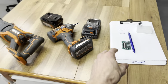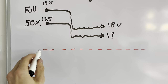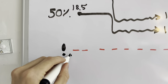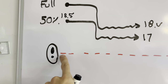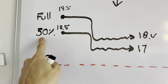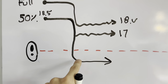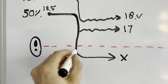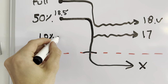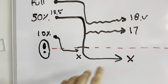Here's how that looks. Inside the battery you have a battery protection circuit. At some low voltage decided by the designers, we call this the zero state of charge, and the battery protection circuit is going to cut off power going out from the circuit at that level. The two ways to get there are: A, you have a fair amount of capacity left but you draw a very heavy load — a very big tool can do that and give you a no-go condition. Or, your state of charge is initially already low and you draw a small amount of current, and this also gives you the cutoff condition.